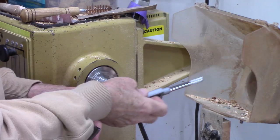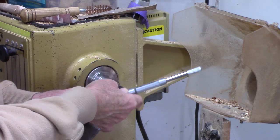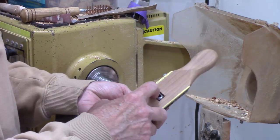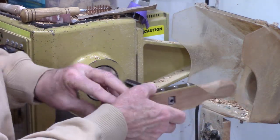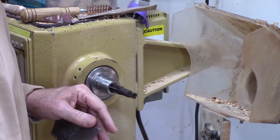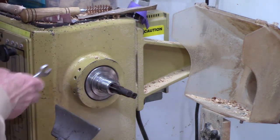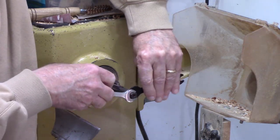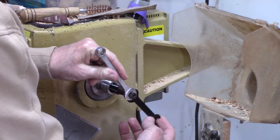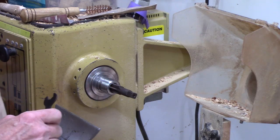The key to using a reamer is to turn it absolutely on center using a tap-and-die type of handle. If a small handle doesn't work, here's an alternative: you could fabricate one by cutting a square hole exactly to fit your Morse taper, then use both hands to turn it evenly on center — very similar to using a Beall tap to cut threaded wooden blocks. Another option is to use a pair of opposing wrenches so you can apply equal pressure on center. You'd also need to use your spindle lock to hold the spindle still.